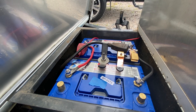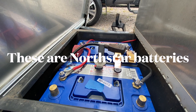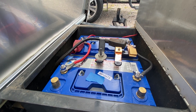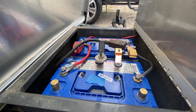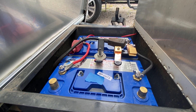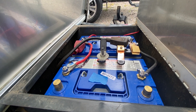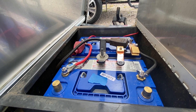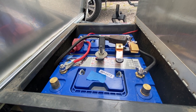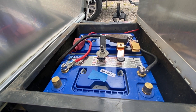This is my battery box, and I've got two X2 batteries from Batteries Plus. The dilemma with this battery box is I don't have a lot of height or width to give. These batteries are only 76 amp hours each, but for this smaller travel trailer with two of them, that's pretty good — at 50% discharge I'd get 76 usable amp hours, which is enough to run lights, the refrigerator fan, the water pump, and to ignite the propane for the refrigerator.